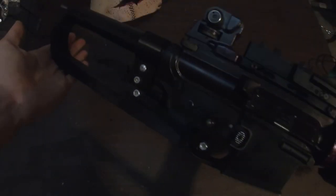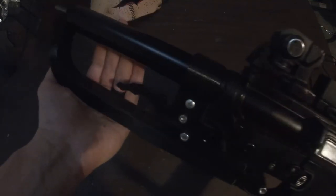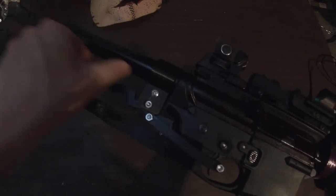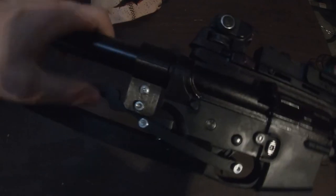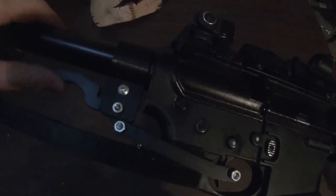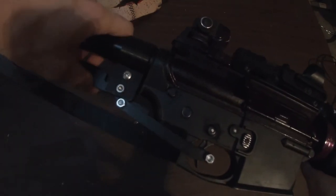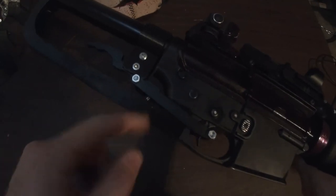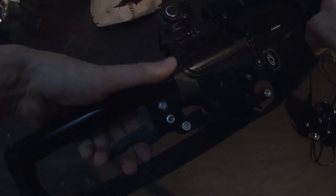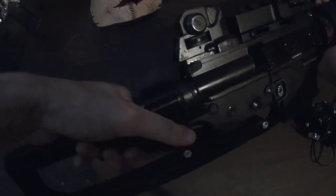The whole fire control group is a pretty simple transfer mechanism. I have a carbine length rifle style tube, like a UTG entry tube. It still has the threaded attachment on the rear for the stock and no rails for a carbine stock. Internally it takes the same carbine buffer. This fulcrum here is clamped onto that tube and it is adjustable rearward. The trigger pivots in that. This bar right here transfers between the trigger and this trigger, and there's a return spring down here, held captive by the bolt that holds the trigger group's cover on. I have a three-finger style trigger here, so you can use your ring finger to cause it to force reset — paintball style, nice and quickly.